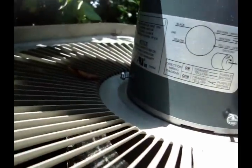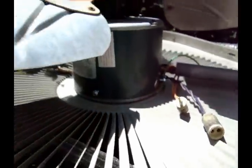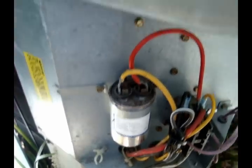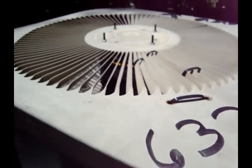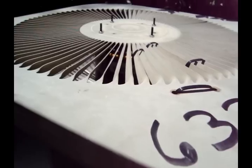We're going to extend the wires down the right way back into the cabinet, instead of splicing them under the fan. We'll take care of that and let the compressor cool down a bit, and we'll see what happens. New motor's in place, unit's up and running. The compressor is a little more happy than it was before.